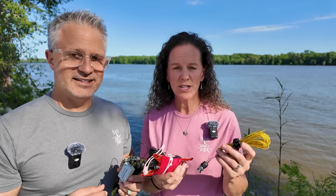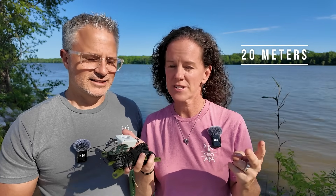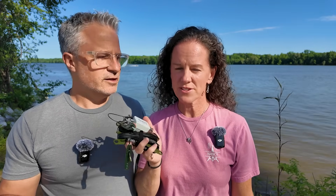So with all these various antennas, which band should you get and how do you tune it? If you had to pick one band, for us it's definitely 20 meters — two reasons: it's the most popular band and for setup it's quick and easy. It's reliable year-round during the day, which is when most people are doing POTA, and because of that there are a lot of operators there. Bands like 40 meters require a lot more space, and 20 meters gives you a sweet spot of reliability and a reasonable-sized antenna — especially if you're going portable. That's definitely not to say 20 meters is the only band; people do portable operations and POTA on all the bands.